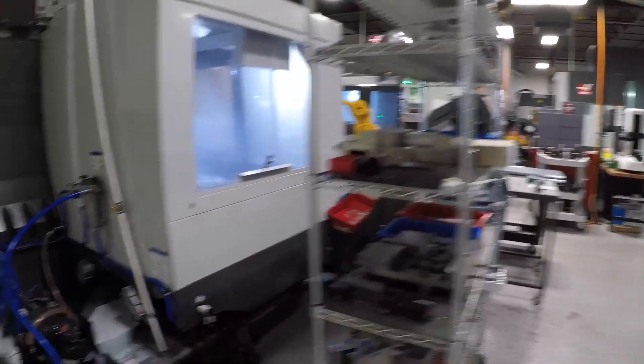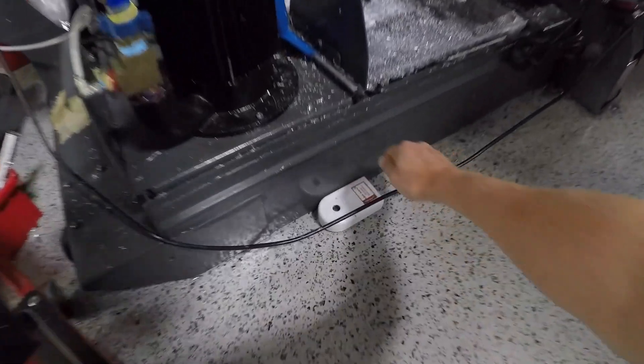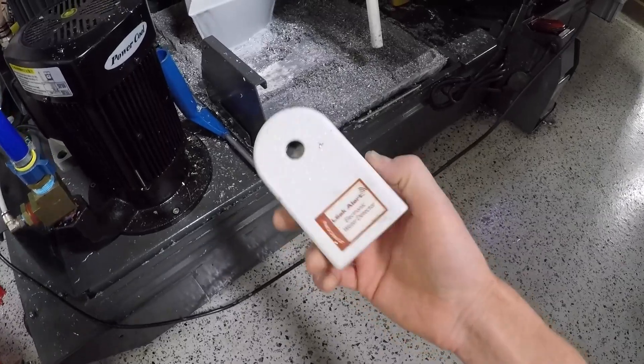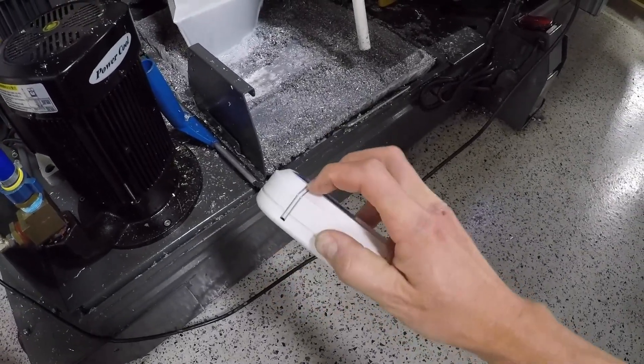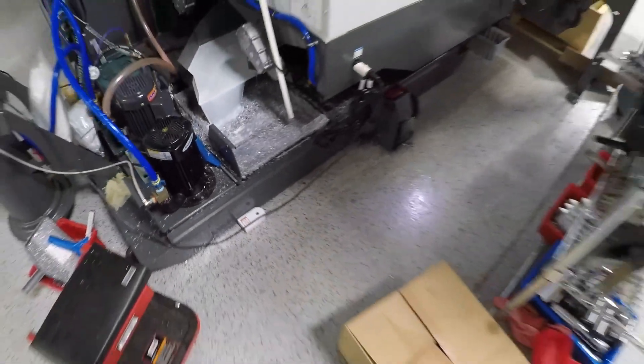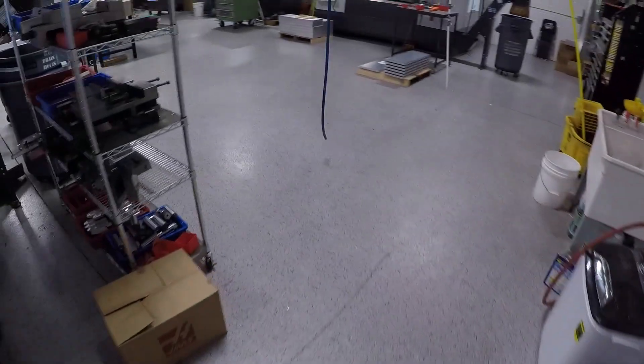If you had a minor flood — and one of those I absolutely insist on if you're running a shop with any sort of coolant tank or water system — buy these inexpensive $20 or so flood sensors. They just take a 9-volt battery. They're simple: if water touches them, they will beep quite loudly. We have them near most of our coolant tanks and we even put one near the bathroom. If we're here, it's going to immediately beep and tell us something's going on. It has already saved our butt once.